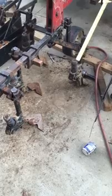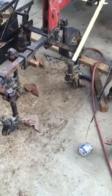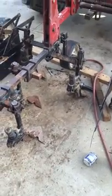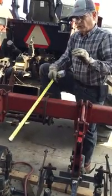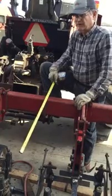Because as soon as you pitch them in the least little bit, they'll start slabbing and throwing soil. And then you've got to slow up. You want to set the cultivator, go to the field, and your objective is to get the cultivator to go 5 miles an hour and not cover up crop. And that's the key.